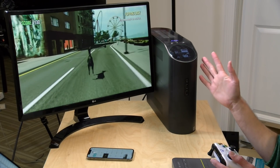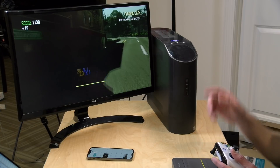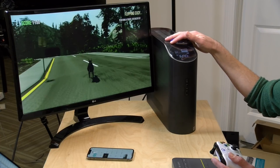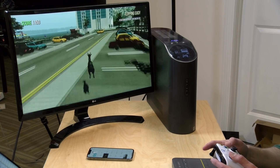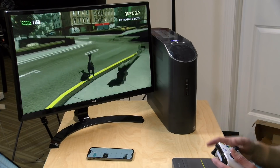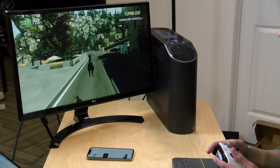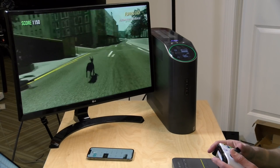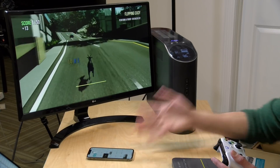Power is now off — it just clicked on and soon a cooling fan will turn on. This will beep every so often to let me know it's running on battery. The display just went dark, probably to preserve battery life, but you can scroll through to see where things are at. It looks like we can run for about 20 to 30 minutes with the Xbox before the battery is completely depleted. You can turn off the beep by holding down the speaker icon. If you're using this to run a router or something low-power, you could probably get a good half hour to 45 minutes or longer. But as you can see, no interruption at all. I can hit the button to restore power and it clicks over very quickly — then back on battery again. No problem. It works like any UPS should, and you do get the pure sine wave that some of the cheaper devices don't have.